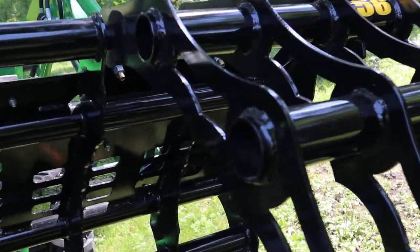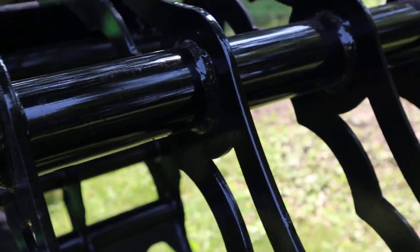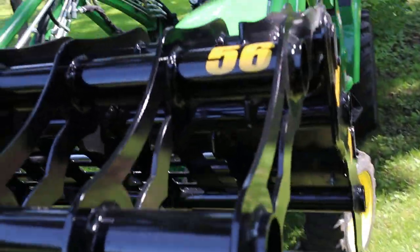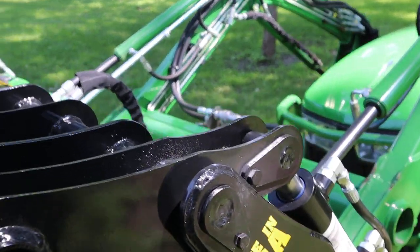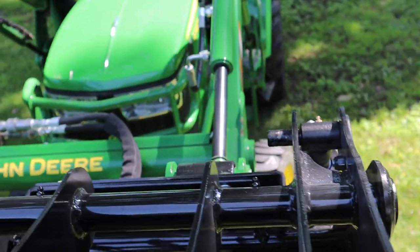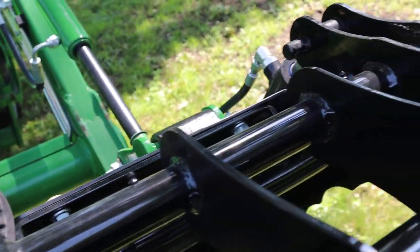We've had a lot of success using round tube and pipe-sized tubes on our skid steer attachments for many years, and we integrated that into this design. You'll notice we use a full wrap weld around every one of these AR tines — quarter inch thick — to the tubes. The grapple alone has three tubes tied into one massive one-inch pin with quarter-inch wall bushing stock, fully greasable.